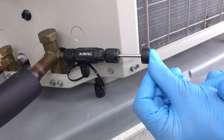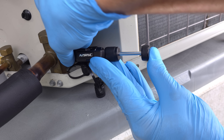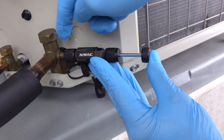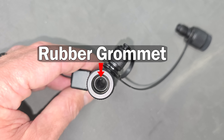A crucial factor: if you've ever noticed the valve core got stuck on the way out and you lose it from the rod, what you can do is loosen this right here just a little bit — not to where you have refrigerant leaking out — but just enough so the rubber grommet is not squishing up against the sides of the valve core as you're pulling it out.